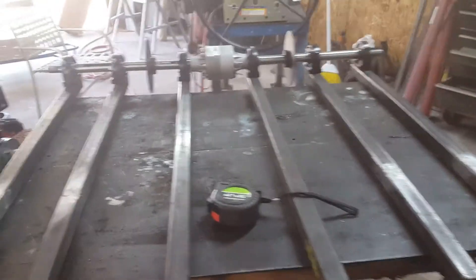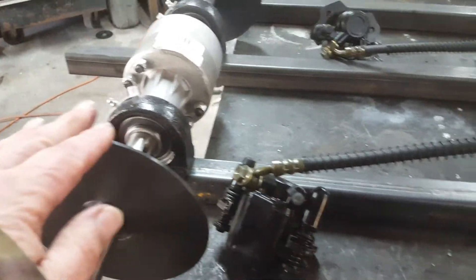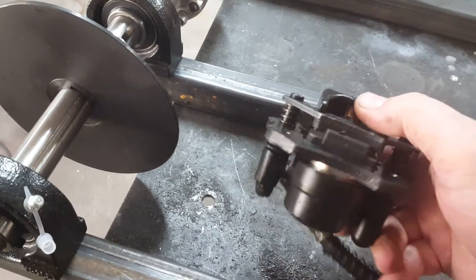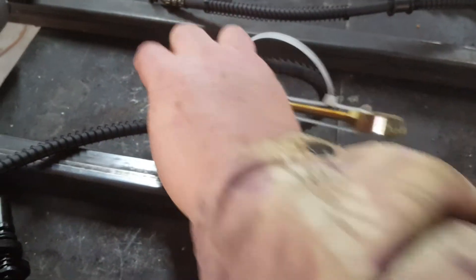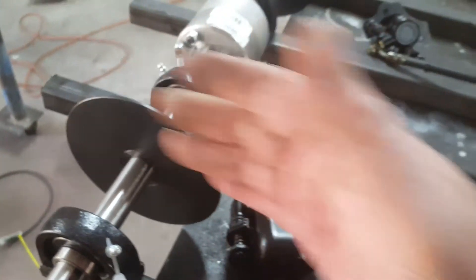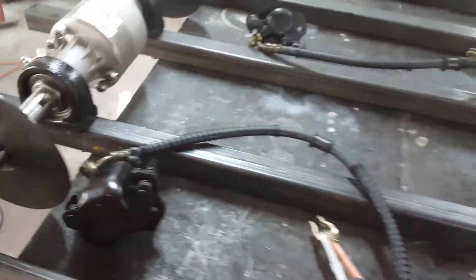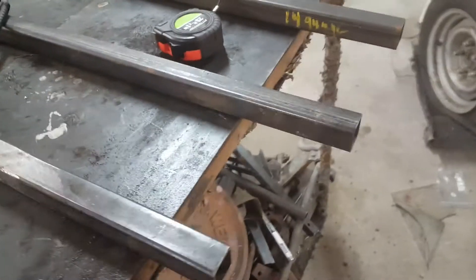Here's another upgrade I'm doing — hydraulic brakes. Our other vehicle had mechanical brakes, they work just fine, but I thought why not try something different. I have some really cool small hydraulic brakes. They'll be operated in somewhat the same way — I'll run the masters over by the steering linkage, and as the steering linkage rotates it pushes the master in, which causes the caliper to squeeze and activates the brake, turning the vehicle. Nothing wrong with the mechanical ones, they're cheaper, but I wanted to experiment. Found them on eBay.